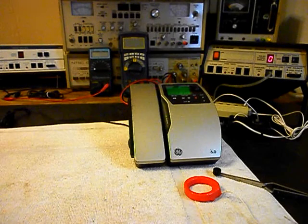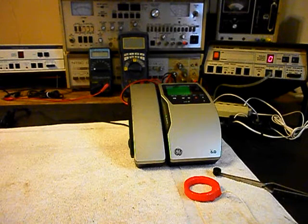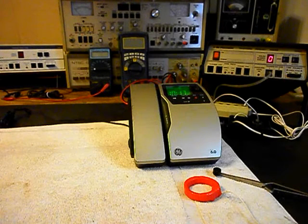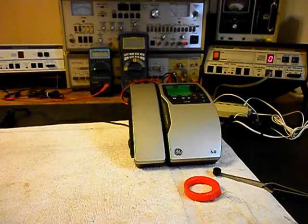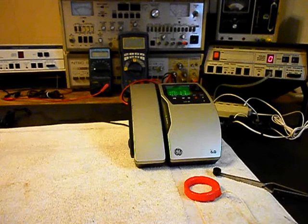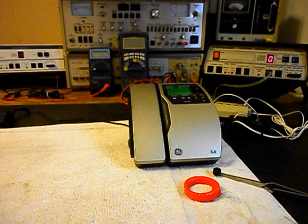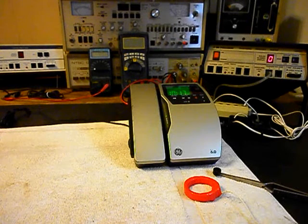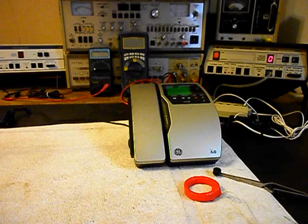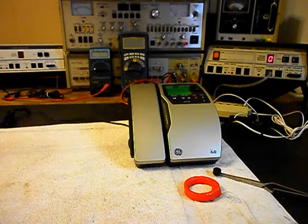The problem is, this is a cordless telephone, and there's a frequency between the handset and the base unit, and that can interfere with the video. It can also interfere with anything that's amplified, and it may sound like an electronic hum. And so that's a frequency override. That's normal, and that's the way they sound when they come in contact with, say, video or anything electronic or an amplification situation. So if you hear an electronic hum, then you'll know what that is.